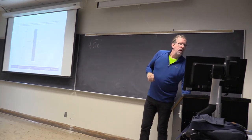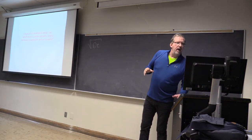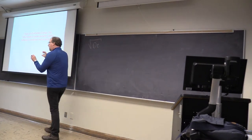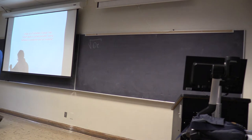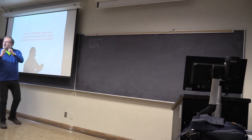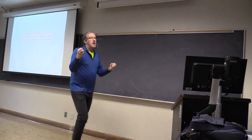And so, if I bring two atoms together, understanding that the placement of those atoms is fixed, the direction, because of the directionality of the covalent bond, the distance due to the constituents that they are, there's this preferred interatomic spacing, and that will lead to the forbidden energy gap. And the reason there's a variation in energy gaps is because there's a variation in interatomic spacings.